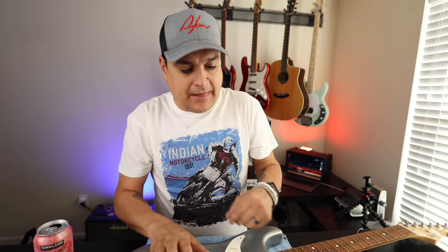Here's why. When I measured with the Gauss meter, the magnets in here are a third to almost half the strength of the magnets in the other guitar. So it's not just about the windings or the DC resistance of your pickups. The frequency response of the pickups is heavily influenced by the actual size of the magnets, the length of them, the height of the pickup, the amount of windings — which is what DC resistance gives us — but also the strength of the magnet. Why would they do this? I'm thinking the magnets they're using are probably cheaper to get than better ones. It doesn't necessarily cost more to wrap more windings to compensate — it just depends where you source the parts.